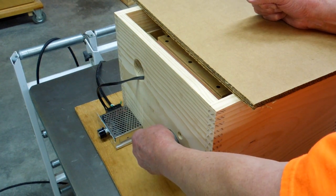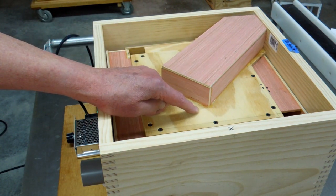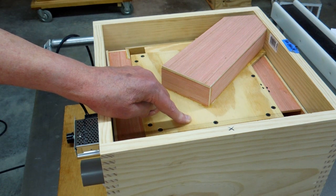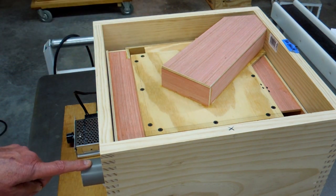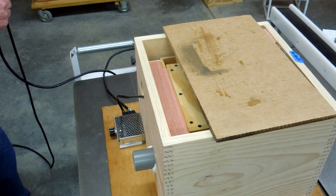So that's quieted that down quite a bit. I was hoping for more. The size of this was determined by materials I had on hand — a piece of 1x12 and a piece of 1x7. The inside box had to be big enough, and I wanted to center that blower and be able to connect to the adapter that comes to this pipe. Everything else was made from leftover materials: quarter inch yellow pine, which is really not very good plywood. This is putting out six inches of water pressure at one third speed and about 16 inches at half speed. I'm not sure how this will hold up long term operating at reduced speed, as a vacuum cleaner blower is really intended to be on or off and operating at full speed.